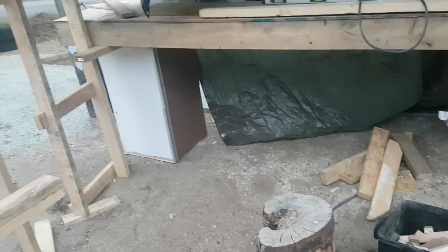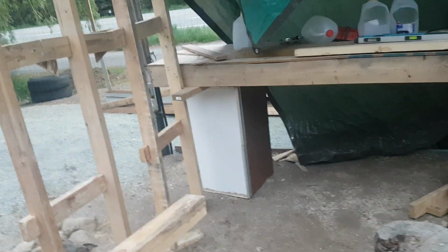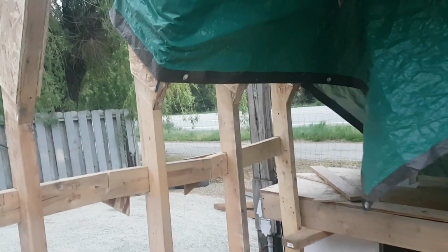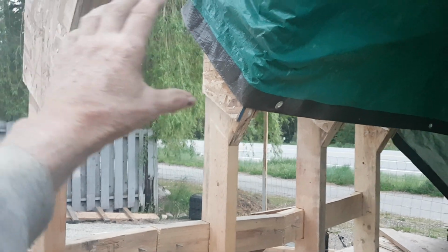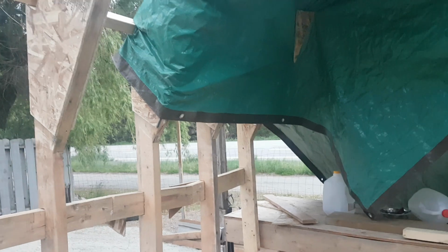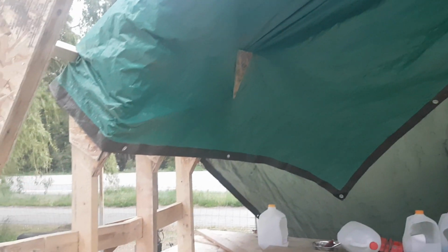So your floor panels would be insulated, and your trusses are just your support, where you could actually put your different utilities. And so for sleeping arrangements, if you're 10 feet up, that still gives you 8 feet floor height here. And so you could actually incorporate probably another beam going across, probably 2x6 going across, or maybe 2x8, I'm not sure. Or maybe just to make a loft area, right?